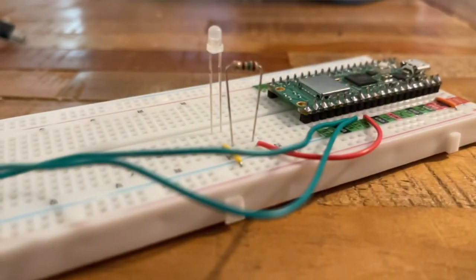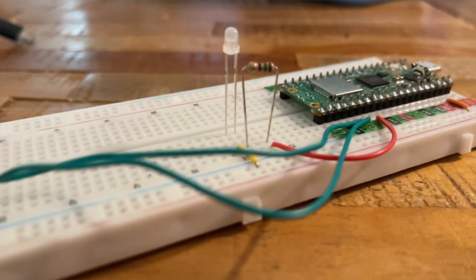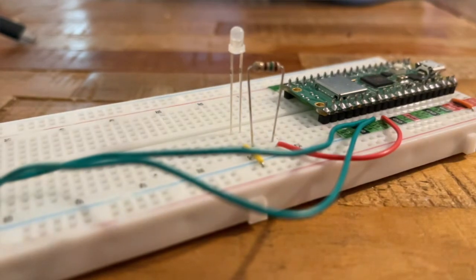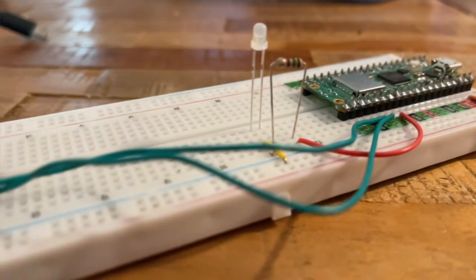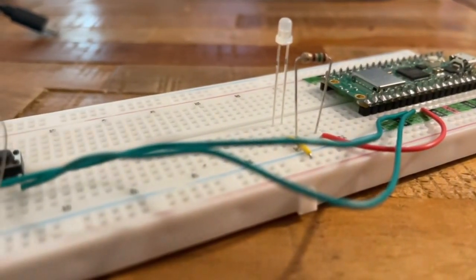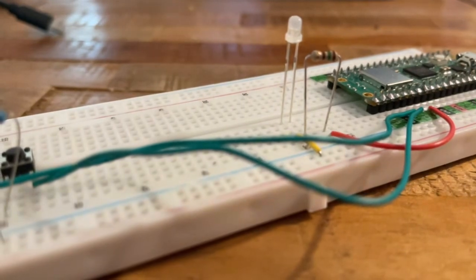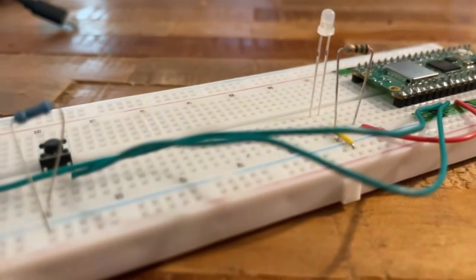There are of course different ways to approach developing for microcontrollers, but I like to start with the code. I simply place a microcontroller on a breadboard and set up networking and the endpoints needed in order to receive commands and return statuses. I then print the commands to the console and mock sensor input. This way I can quickly get a proof of concept and build the hardware around the software.